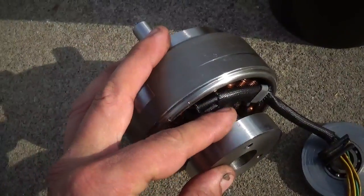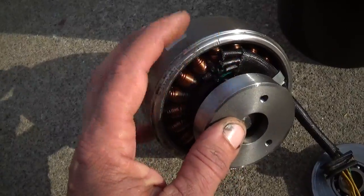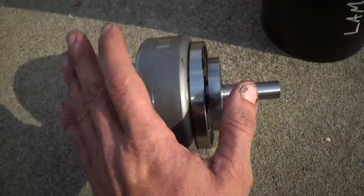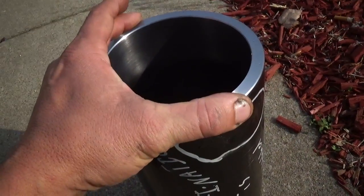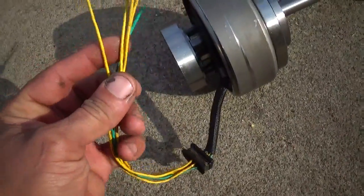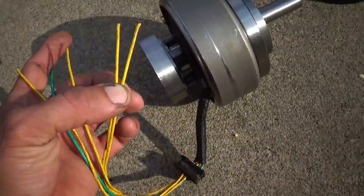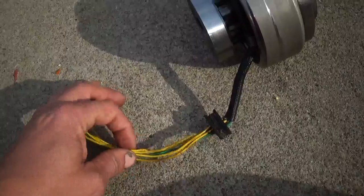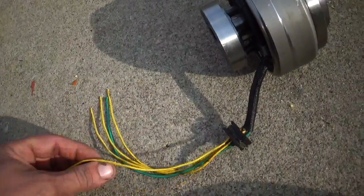I had to put little risers in here because there are little brackets and stuff that hold the wiring, to make clearance for the wiring. Overall length of this thing — it might be about this long, it'll just be able to sit in your hand. It's five and a quarter OD. This is kind of interesting — I've never seen one of these stators like this. It's supposed to have three yellow wires coming out, but there are four. I'd put money on it that two of these are tied together at the source. In the past, one of these wires would power the DC and one the AC CDI.